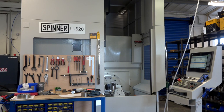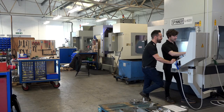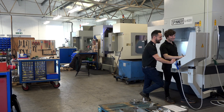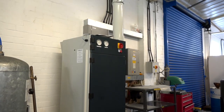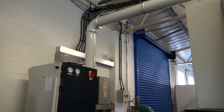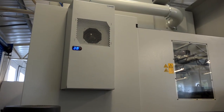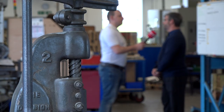It's got quite a high roof on this as well. It's got a high roof because it's got air mist extraction on it due to the through coolant spraying coolant everywhere — you need that facility on the machine. So you're using through-spindle high pressure coolant on the machine? Yes, especially for U-drills. There were a few jobs where we were using 25xD 4mm drills through coolant, so you've got to have it.